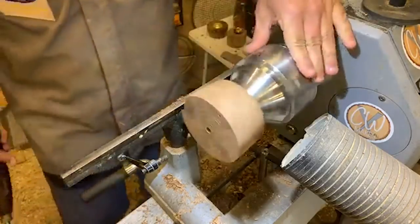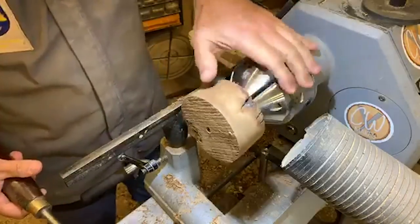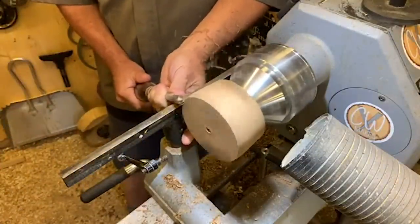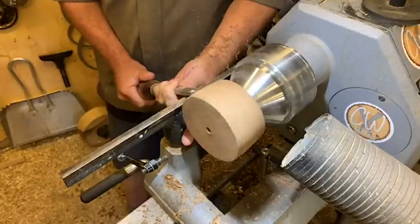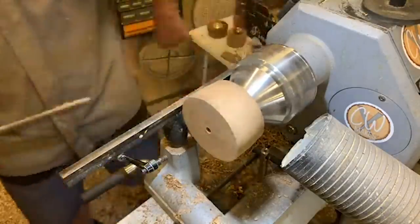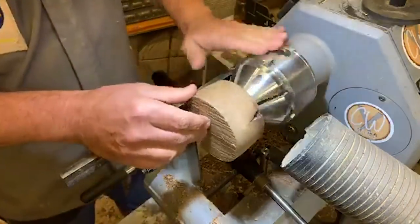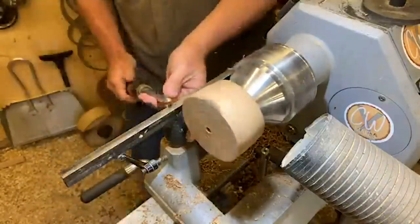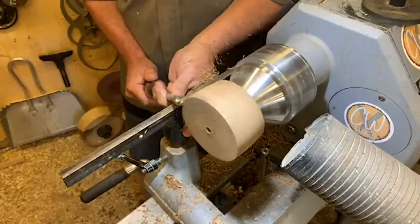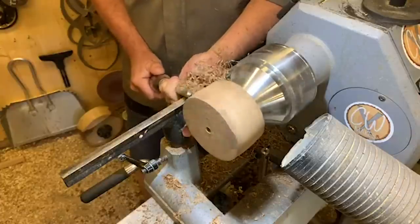Just having a quick look to see where we are in terms of fully round — there's a little bit of a bandsaw mark there, so just another skim. I'll drop the tool handle now and use a skew cut. Someone's asking what angle I grind my signature skew — it's 25 degrees on both sides. You don't have to go that severe; you can go down to 15 degrees if you're accomplished with the skew. But if you're having trouble with the skew, about 25 degrees will really help.